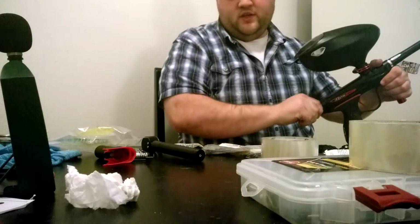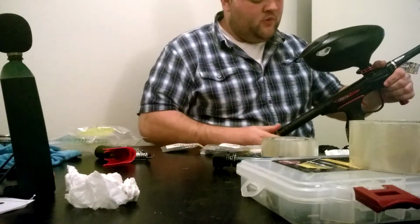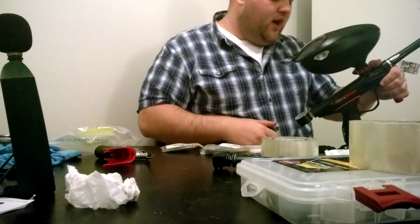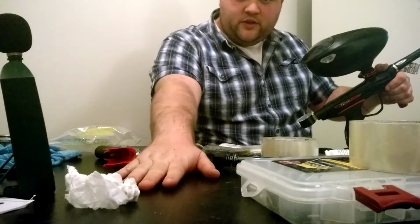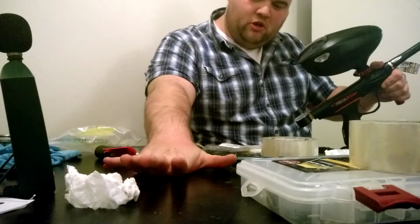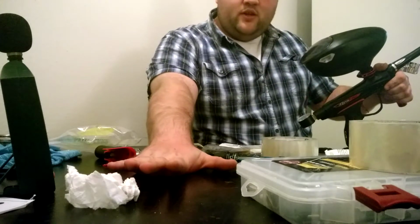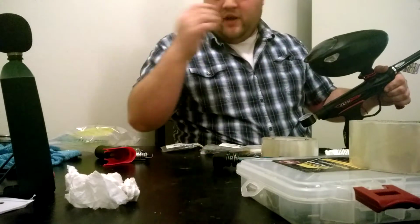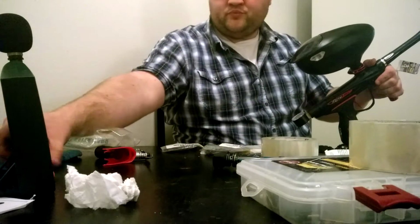And if you're wondering why I'm doing 15 seconds, it's because on most paintball gun markers, you'll see their ABS settings is around 15 to 20 seconds. The longer an O-ring stays sealed against a surface, it creates this phenomenon called stiction, and it just becomes more and more stuck to it. You can read about it, Google it, but it's there, and that's why.